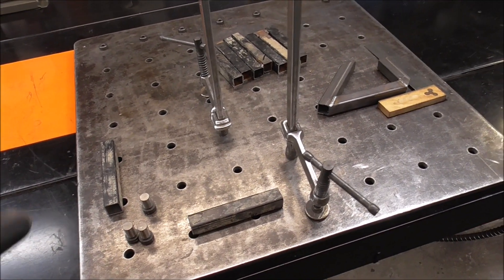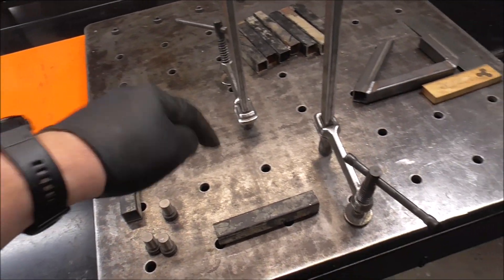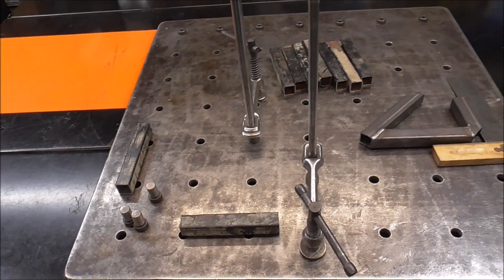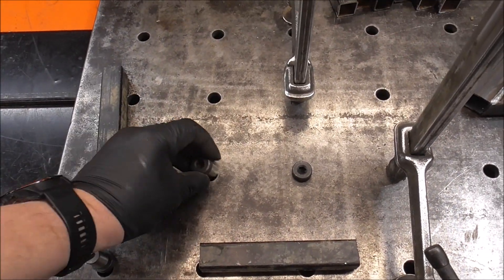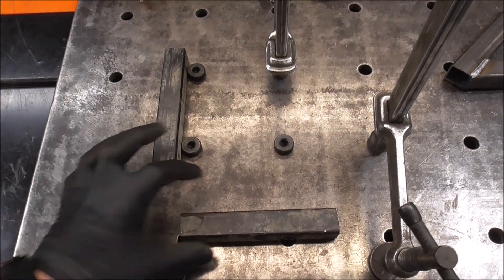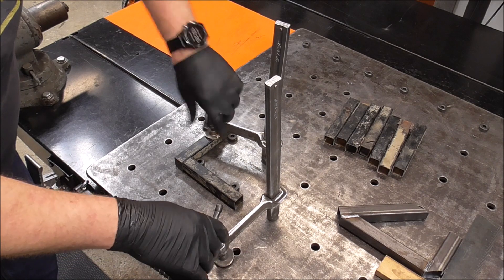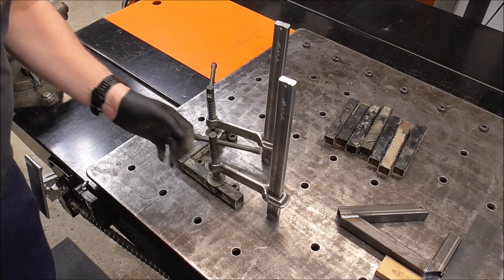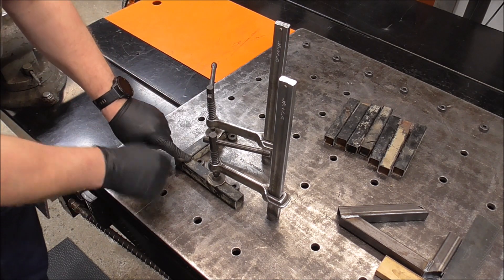This is a fixture table that I built myself. I built an actual template used to make all the holes, so you're not individually drilling them randomly. The template drops the drill down and makes the entire table perfect. It uses shoulder bolts that drop into the table. You fixture down your work, keep it clamped - this makes a perfect 90. Clamp it down and you'd be good to weld. It's going to help eliminate a lot of warping, though it's not absolutely perfect.